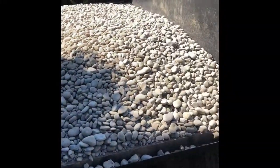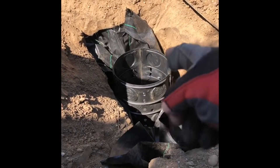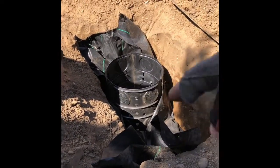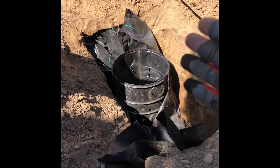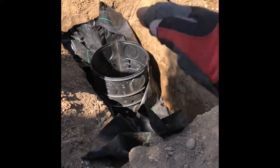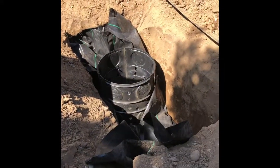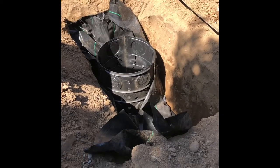There's our gravel — we'll use about three quarters of a yard in this hole. I will cut two extra pieces; this is a six foot long piece of fabric going that way and it'll be flopped out against the walls. I'll stuff two more short pieces on each end and fold that over the gravel so it encapsulates the gravel and provides a barrier so dirt won't get into the ground.